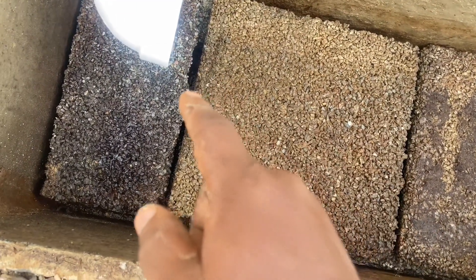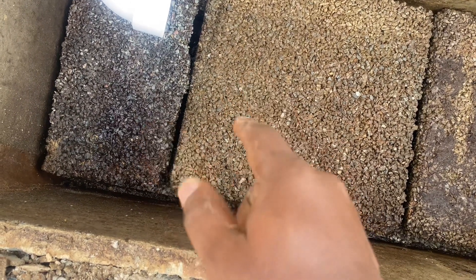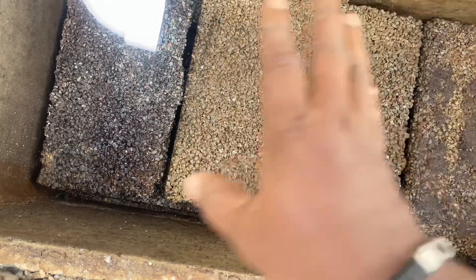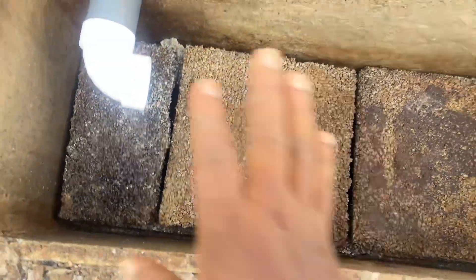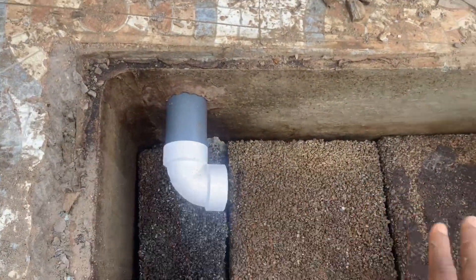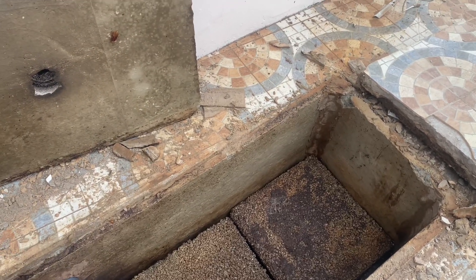This also shows why those who put a basket inside the digester find that it doesn't last — that is one of the reasons we don't put baskets in digesters. We prefer the human waste to spread evenly across all the levels. So this one has been washed inside, it's been cleaned, and all the bedding material has been removed. We are going to relay it with new material, and we are going to do some work at the outlet as well.